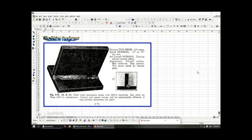First of all, if you're doing welding such as they've done here, a fillet weld on one side only, then if your current in the welding activity is too high, you have too many amps, you're going to start getting a rough surface and a bad undercut in the weld.